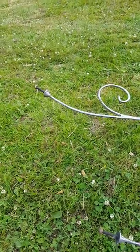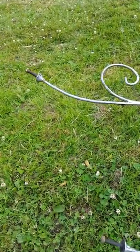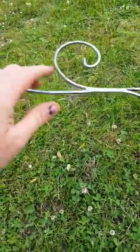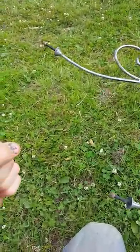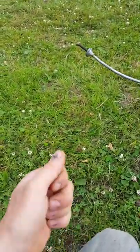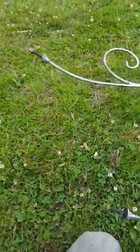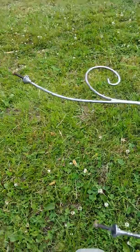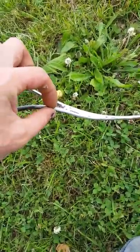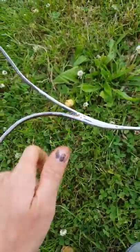We laid out lines on the bench as guidelines to follow for each one of the bends, and then bent these in a bar that was held in a vice with a hole in it — so we could put this through and bend it using the hole. On some of these bits, they were then ground off a bit thinner to taper in before we welded them.